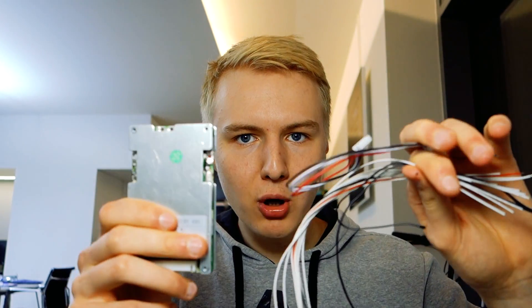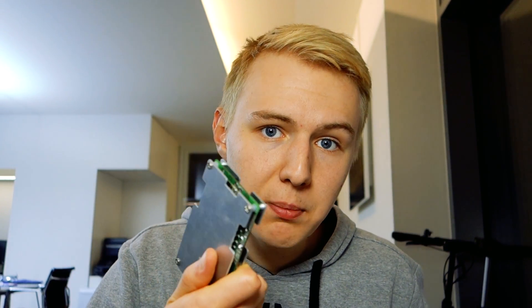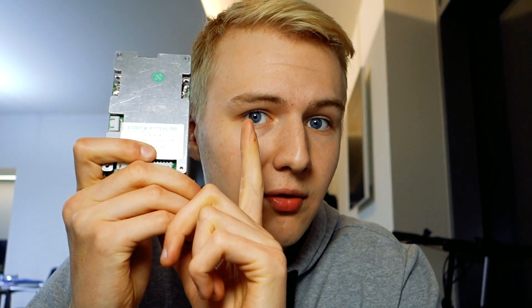These are basically the five components you get when you buy a smart BMS. This one is for a 12S system — 43 volt batteries — and can handle up to 60 amps. I opened it up and the MOSFETs can handle that current without a problem; pulsed, they could even handle 100 to 200 amps. The balance current is around 60 to 80 milliamps, which for a decent battery is more than enough.